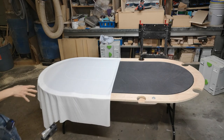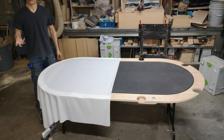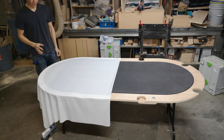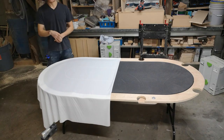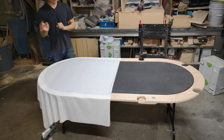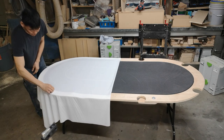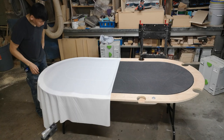Now we have to let that tack up — don't put the cloth down right away. It takes about 60 to 90 seconds for the adhesive to activate; once it contacts the air it gets stickier. If you put it down right away it won't bond well. It also won't be a permanent bond immediately — if you need to readjust you can peel it back and put it back down. You saw earlier how we took off the old felt; it's the same process. So give it a few seconds before laying the felt down.